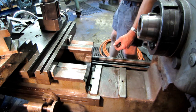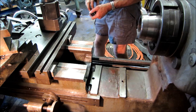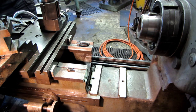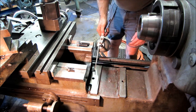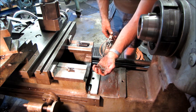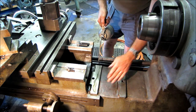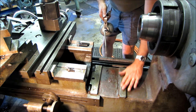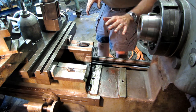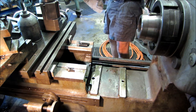Setting the gap - we're going to put the gap on the lathe. We're blowing off our fasteners so we can get them in. The first thing I do is make sure there are no chips. I take some oil and palm it onto the flat face right here, and give a good squirt across this area and across this area right here.